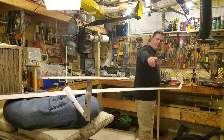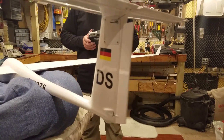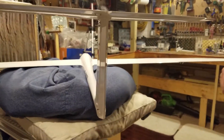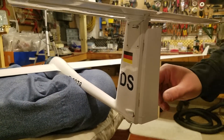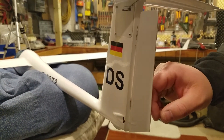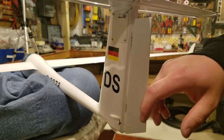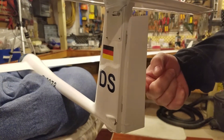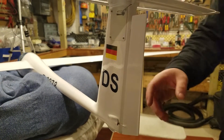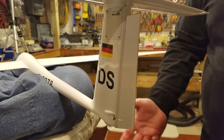So that being said, why don't we give them a close-up shot of the rudder. I ended up switching to a pull-pull system, something I've never used before. If you watch the build series, you'll know what I'm talking about. There's basically pressure here all the way through the range — there's pressure where it matters. On the side where the wind's going to be pushing against it, the air pressure from the flight speed, you've got pressure. Before, it was only true on one side, and you'd go to the other side and you could just push it right out of the way with very little load.